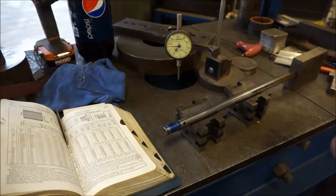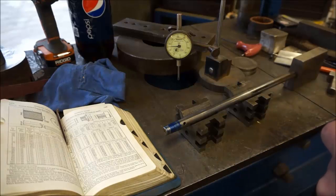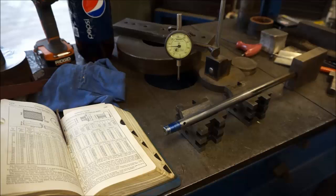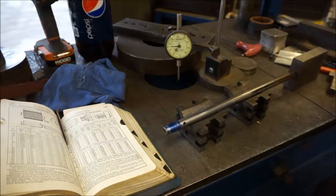I have always coated it and wrapped it in plastic, preventing oxidization. He left a bluing from his test fit on here. And poor fit. The taper seems to be not aligned with the major axis of the spindle as discussed in the email. Looking forward to seeing the repairs."